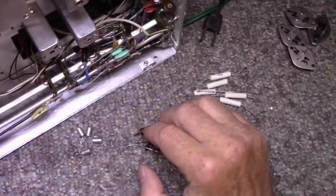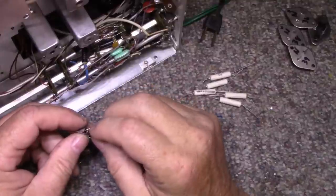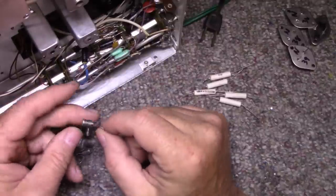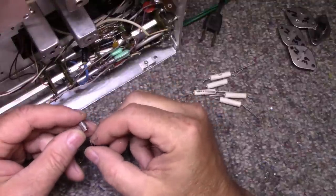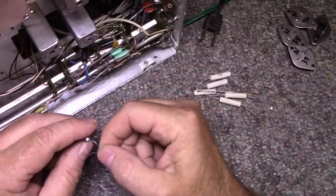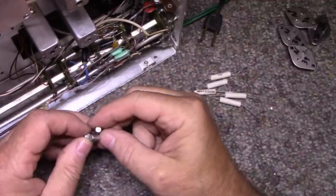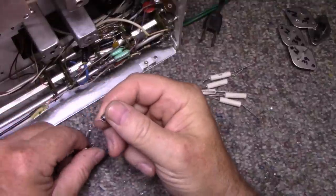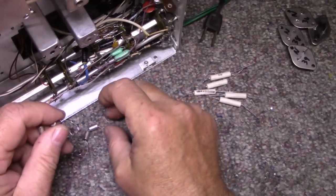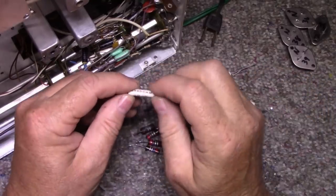I took my digital multimeter's diode check function and these four diodes are actually still good — they're germanium diodes with a forward voltage drop of 0.17 to 0.19 volts. I was looking for data sheets on these but couldn't find any. Similar ones I found have a very low forward current of about 100–200 milliamps max. I don't know exactly what those diodes are doing in the circuit.